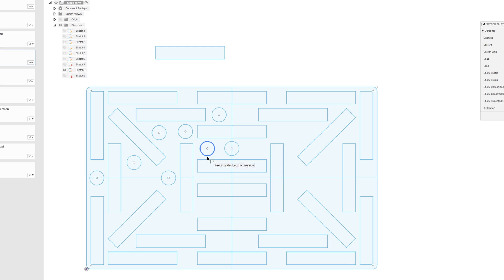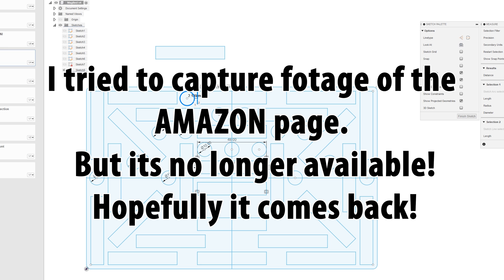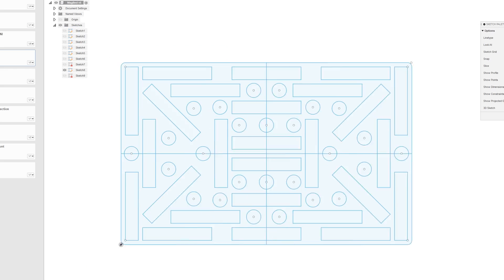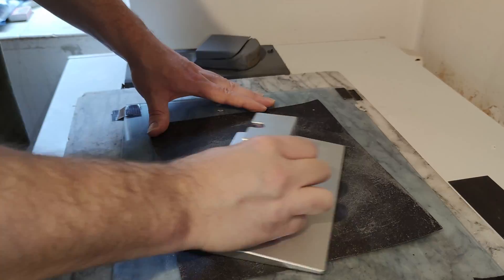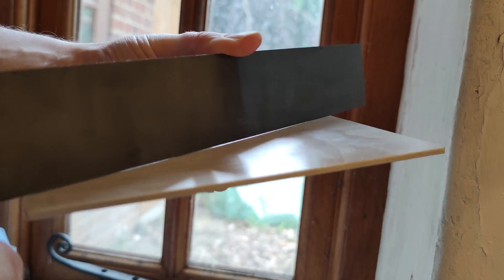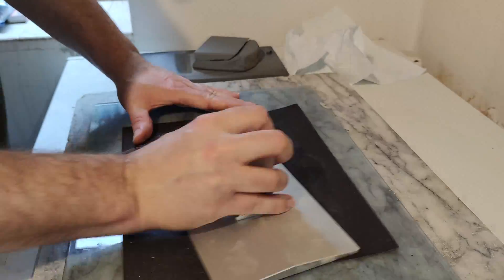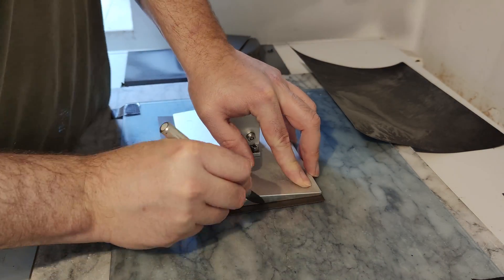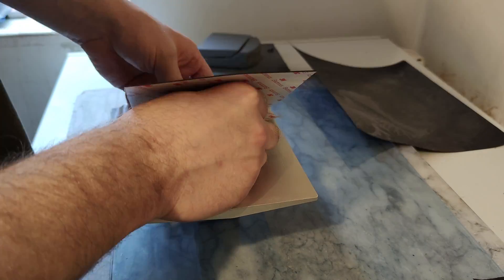So after wasting several months of my time, I decided to take another look at the NeoFlex. Amazingly, this time I had managed to find the same NeoFlex being sold on Amazon for only £10, and not the original £40 I paid before. By this point it was July and I needed to get this upgrade done. I ordered the flex bed and when it came the next day I started getting to work. I took the original aluminium bed and started sanding it back against a granite and glass sheet to make it as true flat as possible, taking as much of the curve away as I could. After a good long time sanding, I managed to get it to something I was comfortable with. I then measured and cut the NeoFlex magnet to size and, after giving the bed another clean with IPA, I started to fit the magnet. Right away I realised I should have gone with this in the first place — the flex plate held onto the magnet really well.